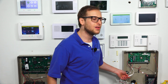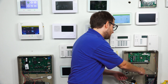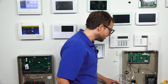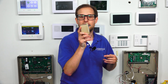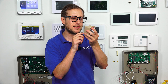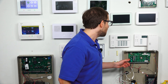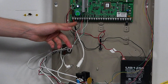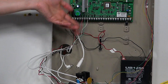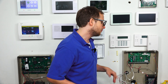We have a Honeywell LT cable connected to the power terminals here, and we can undo the barrel connection. You see the system does stay on because we still have battery power. If you don't have the luxury of a Honeywell LT cable, then you can consider unplugging the transformer from the outlet — it might look something like this, especially if you have a Vista system, with beige coloring. So just unplug it from the outlet. Or you can cut power at the circuit breaker — that's another option. What you don't want to do is undo the terminals while the system is powered on — don't take out your screwdriver and start taking out your power connections there.